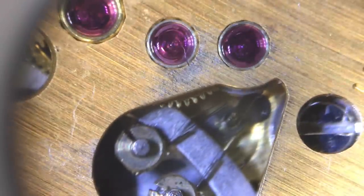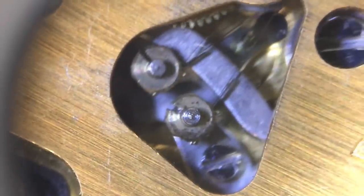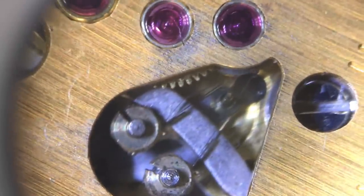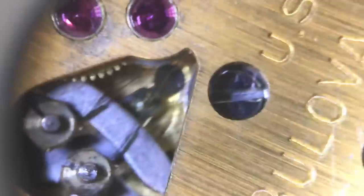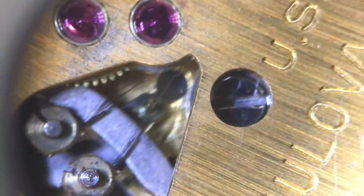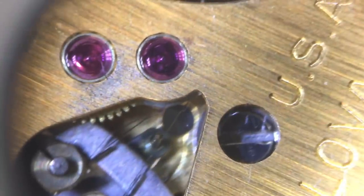I'm going to cut to the bench and we'll start by taking apart the dial side, then move to the movement side. We need to remove the battery first, and we must make sure the crown is pulled out before we do anything, because pulling the crown out stops or hacks the movement. That's important because the little index wheel is probably the most delicate thing you'll ever see. If the movement were still running while you removed the hands, you could spin the wheel backwards against the jewels, break some teeth off, and that's it — it's history.